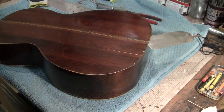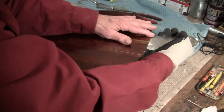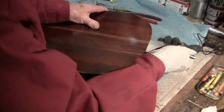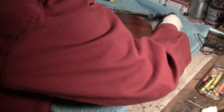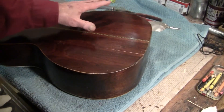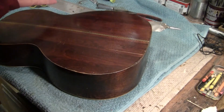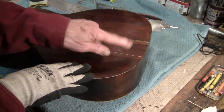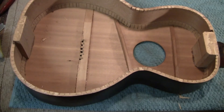Getting started with the hard part. A single edge razor blade and a little force got me to break a piece loose. And now I'm having good luck. This is the wonderful advantage of hide glue. I'll continue to walk around, hopefully without much trouble. What you have to watch out for is when you hit a brace — have to stop, deal with it. No sense in watching that. We're going to peel this top off and hopefully save it. Remember, it's cracked here — it's always been cracked. We're going to fix that. And the top comes off. Top came off with very little trouble.